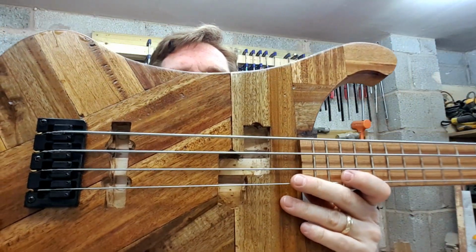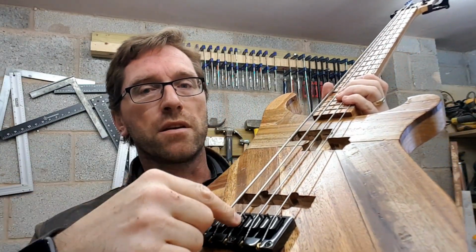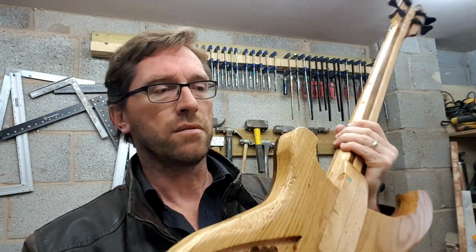I've got to fill those cavities with Geezer Butler pickups. And to do that, obviously, I know they fit already, but I have to drill through so wires can get into the gubbins in here as well. There's also the earth that will fit underneath the bridge that will go into the same patch here. Also, there'll be the input jack, all that. And then, if there's no hiccups, if there's no tomfoolery, and it all works, it'll be time for a live test, won't it?